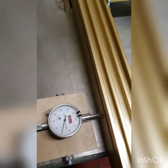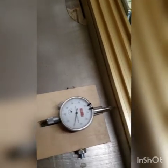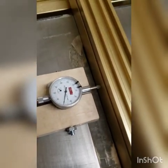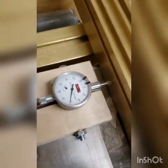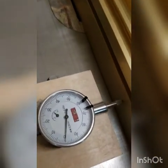The deviations I was seeing before, even though they were just 1/1000th of an inch or so, were largely being induced by the slop in the guide that is riding in the miter slot. And so by adding a little bit of torsion to it as I slide it along, it takes that out.